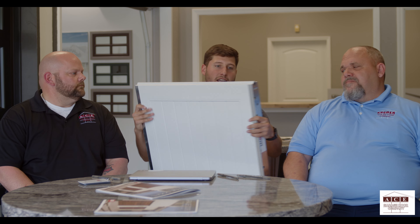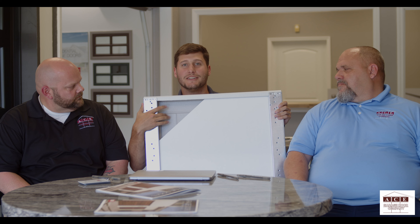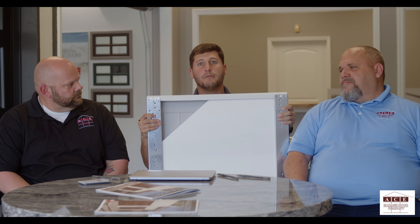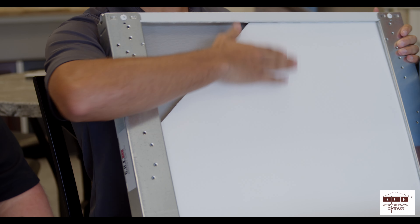As far as different variations on the doors, you can do insulated versus non-insulated. This is a stamp carriage door, and as you can see on the back right here, that's where your normal garage door is — that's no insulation. If you'd like it a little cooler, you can add vinyl back insulation. There are also two more serious options with steel back insulation: one layer of steel in the front, another on the back, spray-foamed with insulation — either polystyrene or polyurethane, depending on what you like.